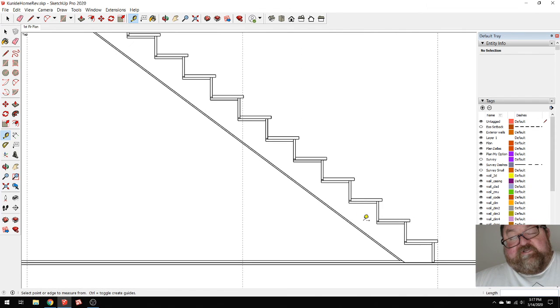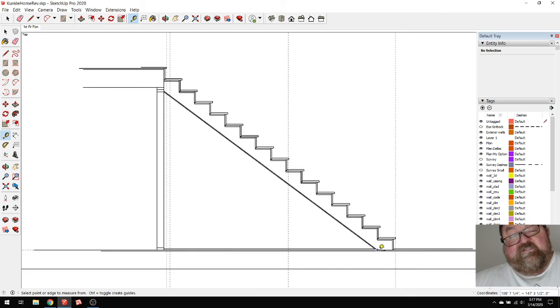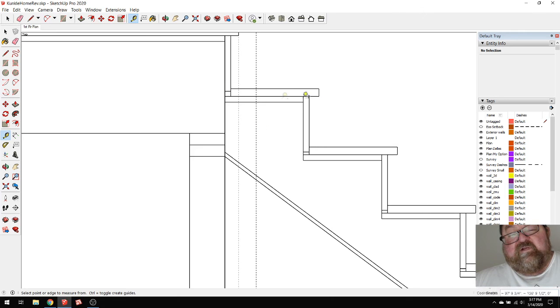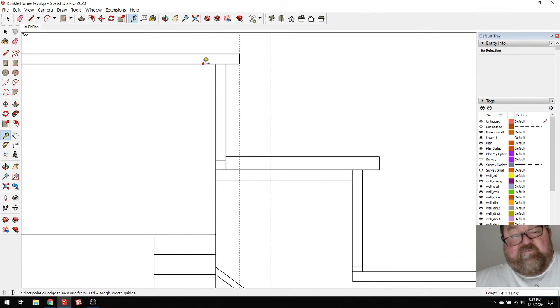And so what I usually do is I'll cut my stringer. I'll just cut these top 2 cuts and the bottom 2 cuts, and I have all my pencil marks on there. I'll set it up here, and I'll put a level on that cut to see if it's level. And then I'll measure down. See, this drawing allows you to measure from your subfloor, which is all you have when you're framing. You don't have your finished floor there right then, down to the top of your stringer.